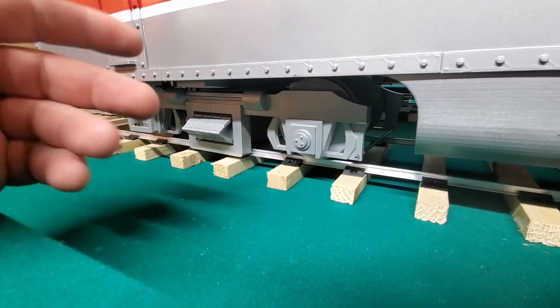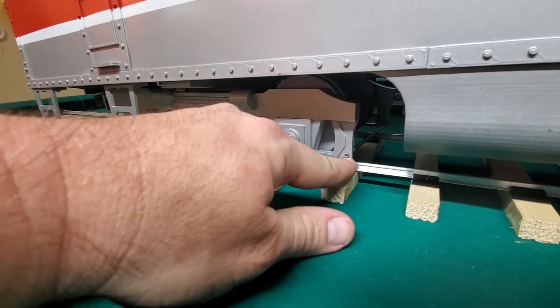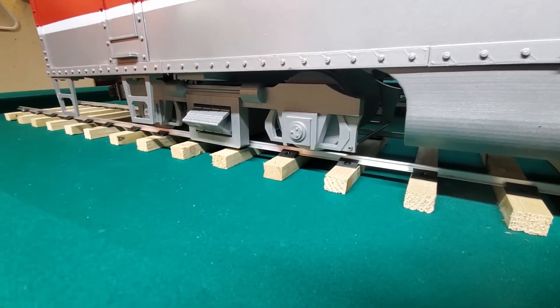I think what I'm going to do is have aluminum axles turned and then just 3D print my wheels and truck, because everything else is fine - it's just that straight downward shear force on an axle that's printed vertically. I made these trucks so they disassemble; you can see little bolts here connecting the rods, it's kind of bolted together in a few places.